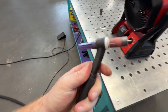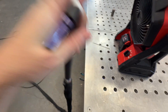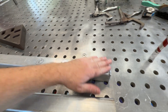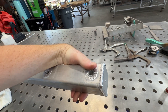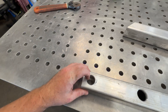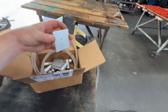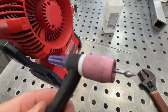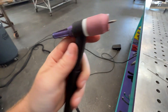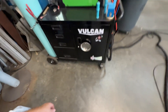I switched over to my aluminum setup — I like to use a number six standard cup and collar with a 3/32 inch tungsten. I've got these little bung things I got to put in here and weld them, look at, grind down after, and a little end cap on the end. Somebody dipped the tungsten so I had to get a new piece. I like a number eight cup and a gas lens.